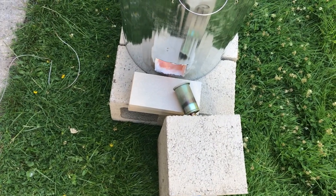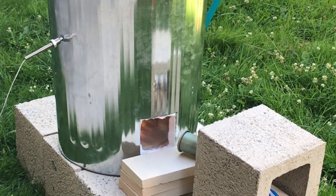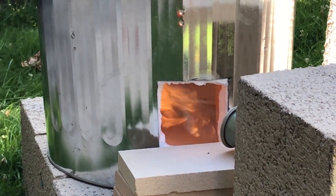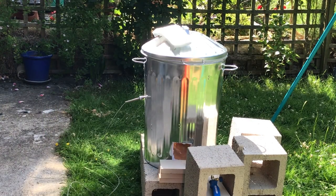I was advised to make three changes to the setup to help the kiln get up to temperature. The first was that instead of having the burner going into the kiln at a 90 degree angle — going dead on into the kiln — instead have it angled at about 45 degrees. That helps because rather than the flame hitting right at the centre of the kiln, it scoops around the interior surface. I was also advised to have the burner slightly further away from the burner port so that it would draw in a bit more oxygen — keep it about a couple of inches away.